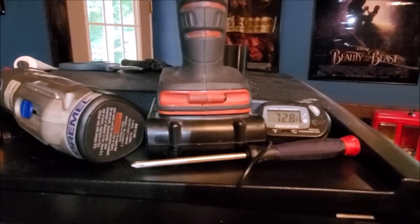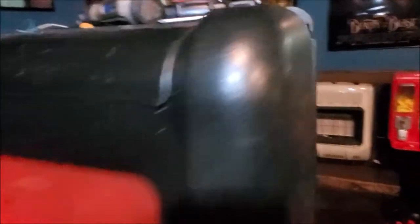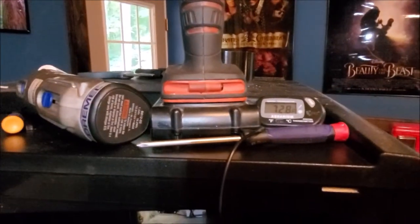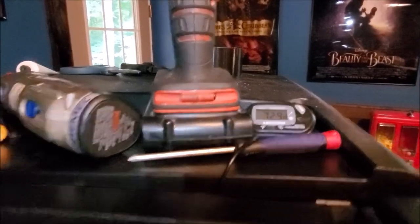Let's take a quick peek inside. I got the unit all wired up and it's 72.8 degrees in there because it's about 72 degrees in here. Inside I got our thermostat switch set — it's showing 77, while that other one shows 72.8, so a little bit of a difference. I have it set for 70 degrees right now to shut off. Eventually I'll have it shut off at 35, but I just want to make sure that actually works. Around the back here, I soldered the connections and used liquid electrical tape to cover all the connections.